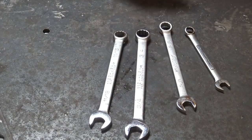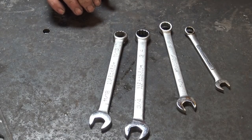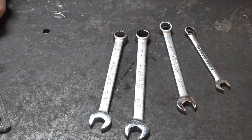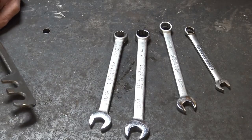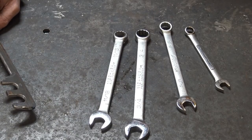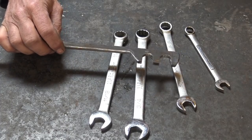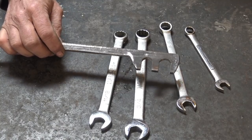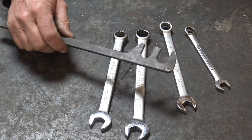You've probably already got a set. If not, I wouldn't necessarily go out and buy a set of combination wrenches just because you need gap gauges. But if you have extras laying around, or if you've got a cheap set that you later replaced with a nice set, using these in the blacksmith shop as a measuring device is good. If you need something simple, this shop-made version is not hard to make — it took me about 15 minutes using a drill press, bandsaw, and a file. That's really all that goes into it.